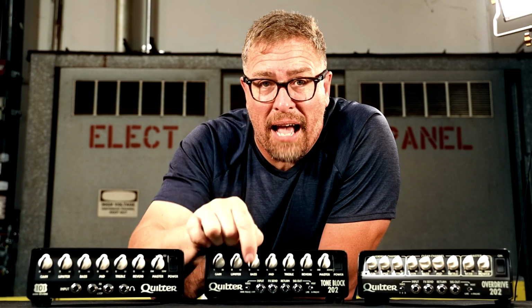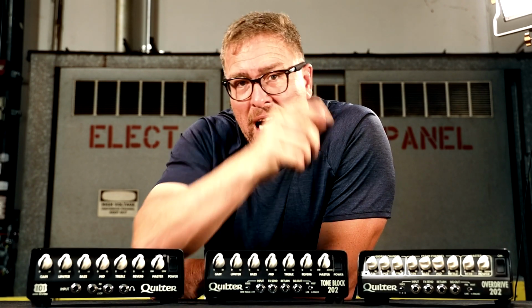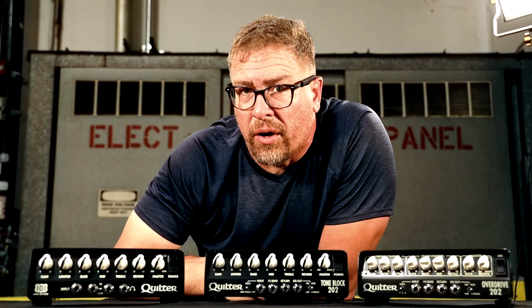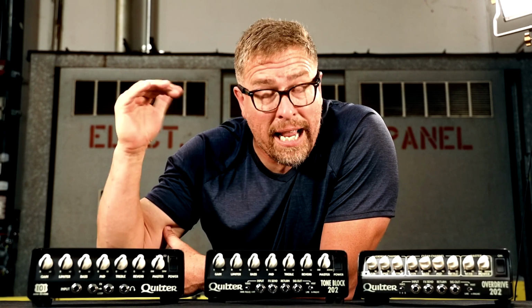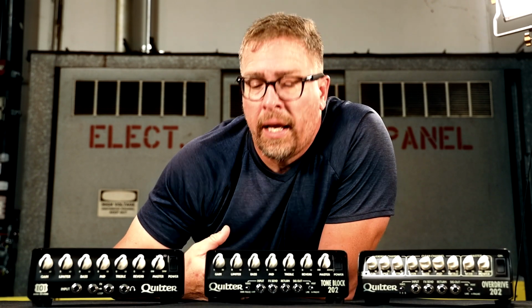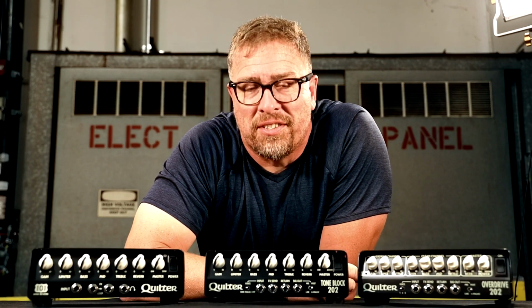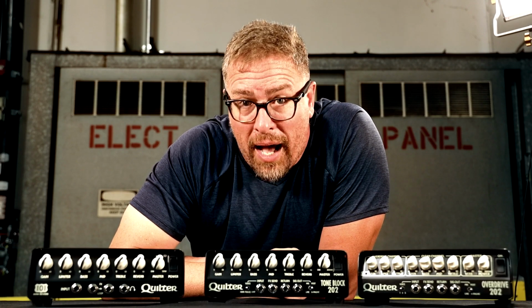Now, check me out. The FR mode stands for full range frequency response. That's for you modelers out there. It does more than just play a clever trick of the EQ though. It actually changes the output impedance of the speakers from a high output impedance, low damping factor, typical of tube amplifiers. Come on guys, we're famous for making amps that sound like tube amps. To a low output impedance, high damping factor, ordinary solid state amplifier. Perfect for those of you who are using cabinet simulated modelers.